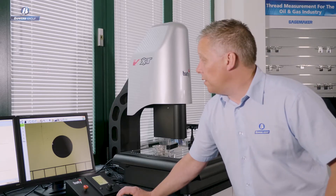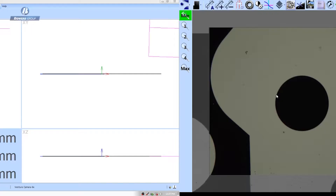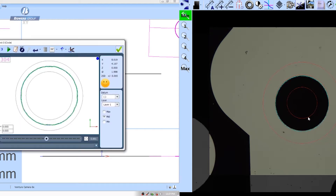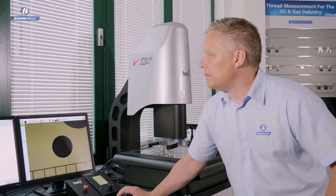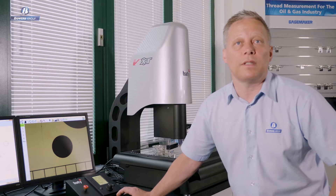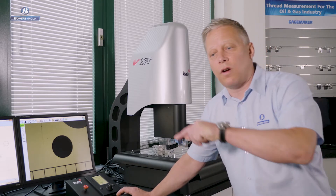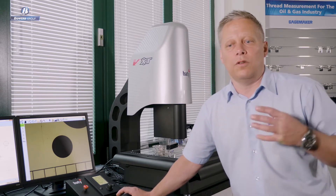Let's bring a circle into view. Using the auto-select tool in the toolbar, the software automatically selects a circle tool. Same process — I've got a scanning width and I've scanned a nominally 2mm diameter circle, taking 304 data points. That gives a very accurate calculation of the diameter, and also a very good understanding of the form of that circle, because 300-plus points around a 2mm circle describes its shape extremely well. Vision gives you a good understanding of form error as well as the nominal geometric result.